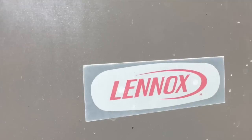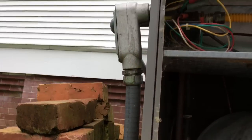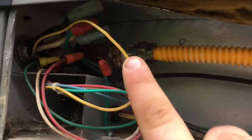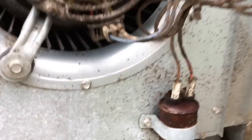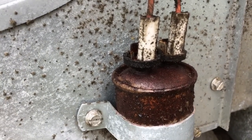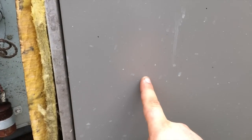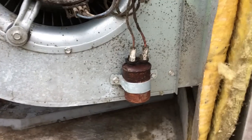What's up YouTube, we're working on a Lennox package unit here — it's a gas pack. I saw the electrical coming in right here so I assumed all the electrical was right here, but it's not. I already found one problem: I was called to check this out because he's selling the house. This is all dirty and you can see that capacitor is a little fat, so that's going to have to be changed out. They didn't say what the problem was, they just said it wasn't working, so I know the blower's not going to work with that capacitor.